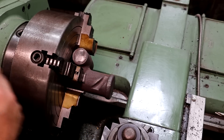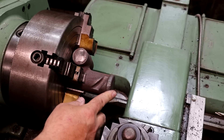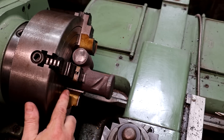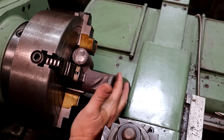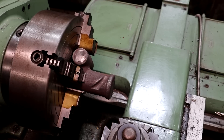So what we're going to do is go ahead and drill this out on the lathe. We will start by center drilling this. We'll use a 5/8-inch drill to drill all the way through. Then we'll come in there with that 1 and 5/32 inch diameter - that will not go all the way to the bottom, there'll be a gap in the bottom. And I'm also going to face the top of this. The originals are faced on the top, the bottoms are left as rough casting and we're going to do exactly like that. So anyway, let's fire it up and see if we can get these holes put in there.